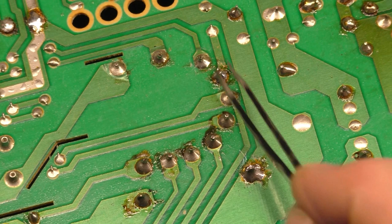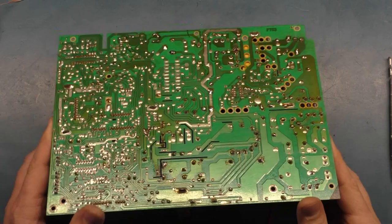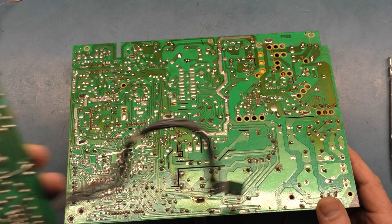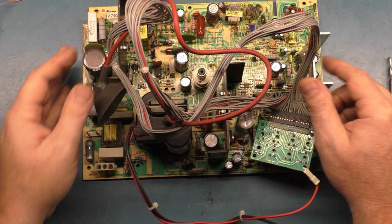If need be, then I'm going to do all the cap kit and the reflow and the inspection, make sure nothing is amiss. If I find something amiss, I'll talk about it when I come back. But I'm going to cut away. I'm going to do the cap kit, the reflow, all the rework, especially on what I mentioned before about the header pins, video header pins, power header pins, all that kind of stuff. Anything else and everything else that might need it. We'll do the rework on the neck board. I'll show that off when that's done. So when I come back, I have all the work done, and then we'll be ready to test it again and see if it was just bad caps or bad solder joint, and then if not, we'll have to troubleshoot further and see where we're at from that point. So here we go.